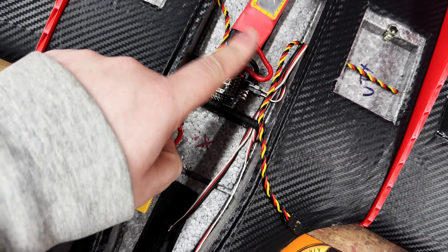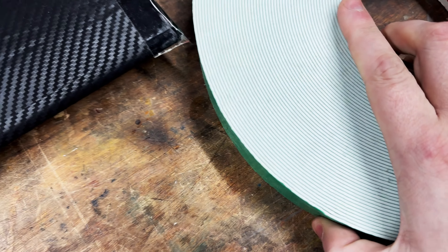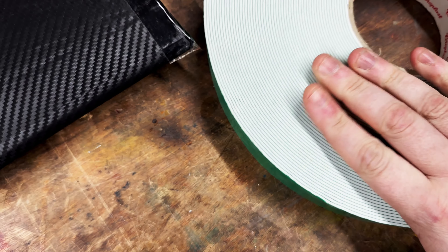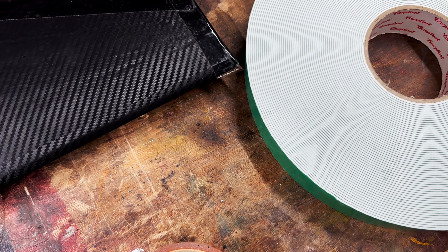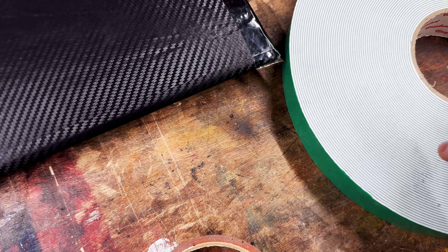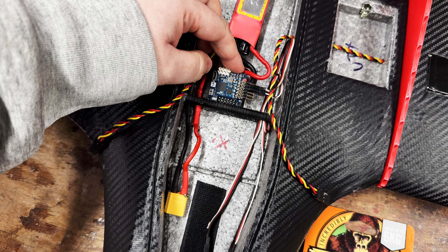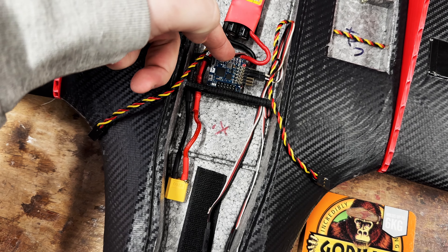Because the old flight controllers - these are also about 38mm square - I think with it being slightly bigger, water was getting underneath and popping stuff off. It's spongy, so it was good for mini quad frames where you were bolting things to carbon fibre and all the vibrations came through. But this is a foam wing with only one motor, so I think we'll be fine.